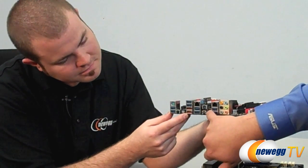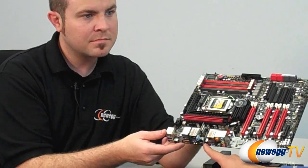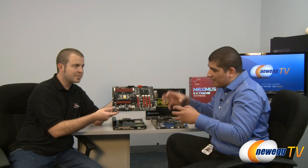That's also via the ROG Connect USB port. We also have USB BIOS flashing. When people first get this board or want the latest BIOS, no CPU, memory, or graphics card is required. Just take a flash drive, put the flash file on it, stick it into this port, hold down the ROG Connect button, and it will low-level overwrite the BIOS in real time. All you need is standby power connected.